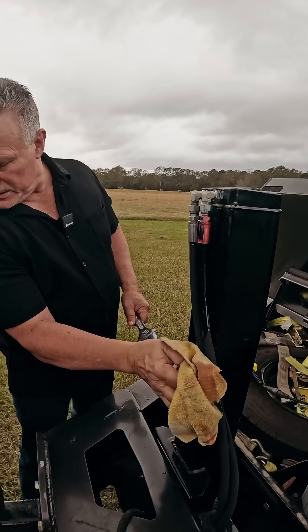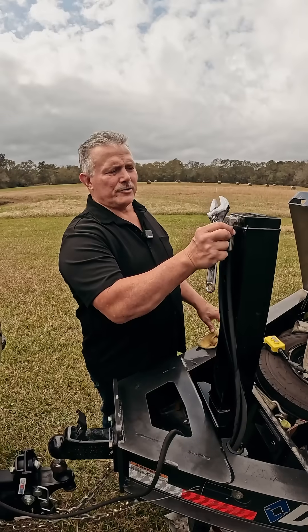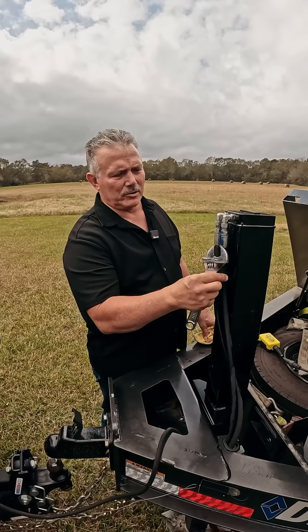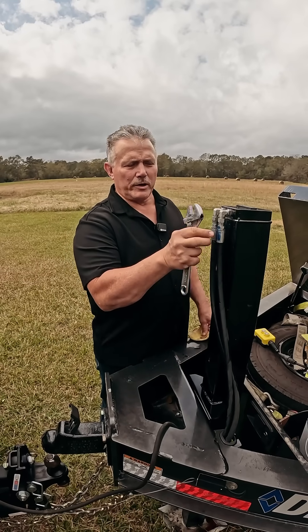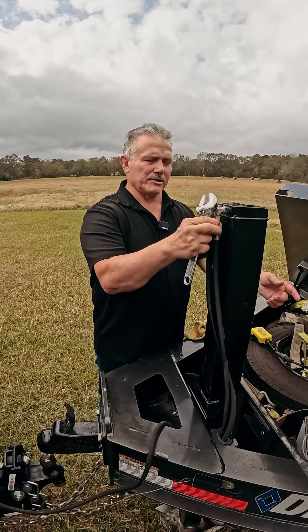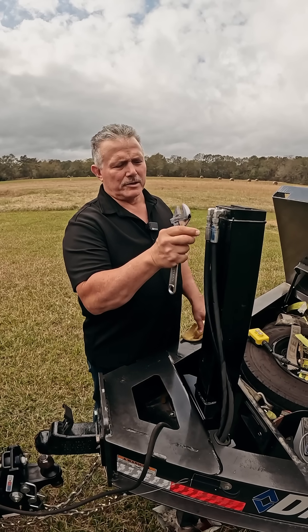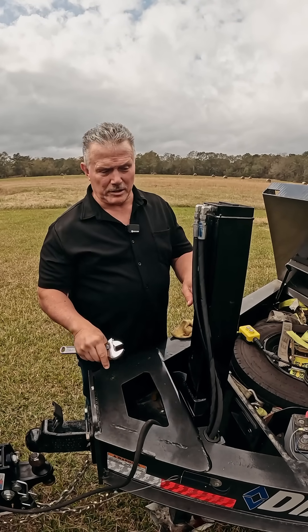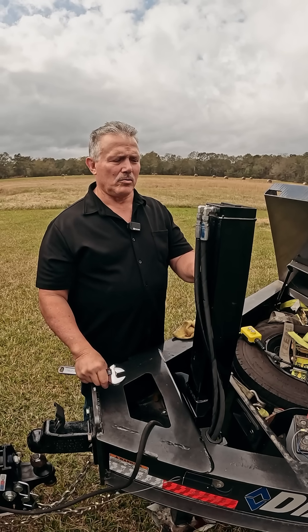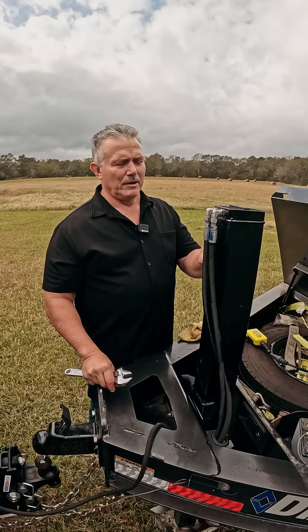It's really coming out now — it's beginning to go down and is resting on the ball. As you saw when it began to seep out, that was similar to a hose failure, or what it could be as it seeps past the spool valve on the pump itself. We proved by that seepage and the trailer going down that this jack had no integrated counterbalance valve in it.